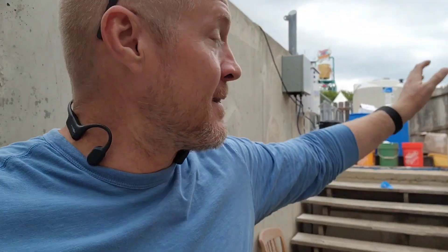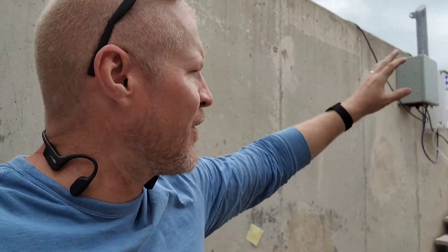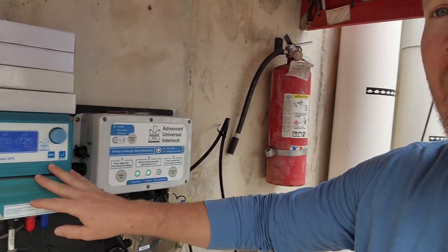This is a perfect fit with Clear Comfort's AOP system. They need 110 volts — it uses very little power, but it needs 110 volts. Our XPC needs a closed dry contact switch that powers it. Maybe you're not using an ORP controller — maybe you've just got a bleach pump and an acid pump plugged into the wall. I have been gassed dozens of times, at least once a year, during my career before coming to work here. It is amazing to me that I have never encountered chlorine gas in an equipment room while servicing it the entire time I've worked with Fulcher. And the reason why is that we take our safety switches and safety interlocks seriously. This brings just another step to that interlock experience.